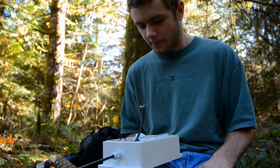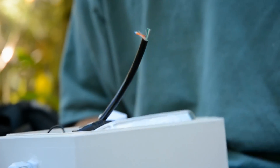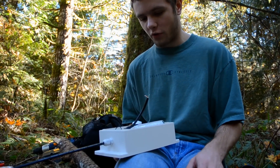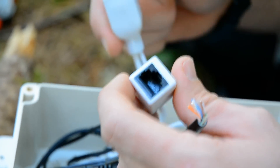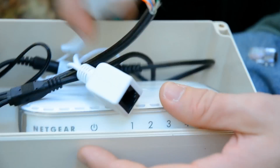On 100 megabit Ethernet signaling, only four of the eight wires are used. There are eight wires in a Cat5 cable but only four of them are used for the actual Ethernet, so it leaves four wires essentially left over — two pairs — for carrying power. So we have data on two of these pairs and on the other two we have basically 50 volts, and then at each point we step it down to the 7.5 volts these switches run on. These are off-the-shelf passive Power over Ethernet injectors.